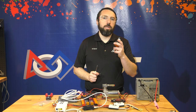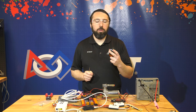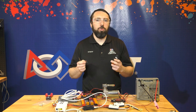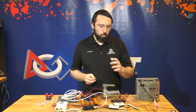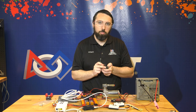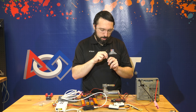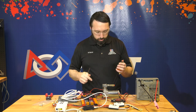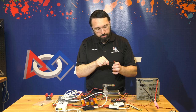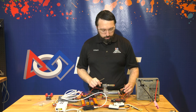The next component to wire is the robot signal light. This light shows the operating state of the robot — it will power on when the robot is on and stay solid, and blink when the robot is enabled. This helps field personnel understand the state of your robot and aids safety when operating in your shop. Wiring this consists of two components. First, we need a jumper wire between the two outside terminals labeled LA and LB. Take a small amount of wire, form it into a U-shape, strip both ends, and insert it. We can tighten down one end — we'll choose LB. It doesn't matter which terminal you put the second red wire in because the jumper connects across.